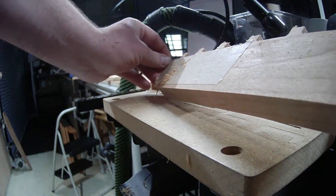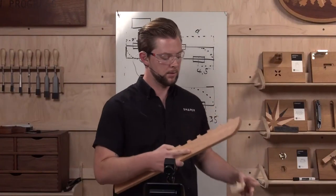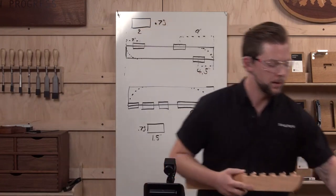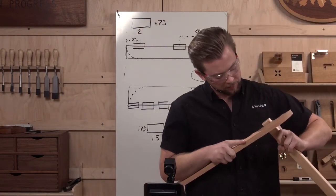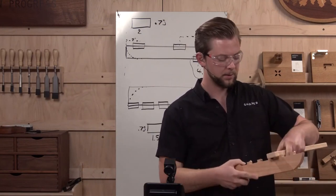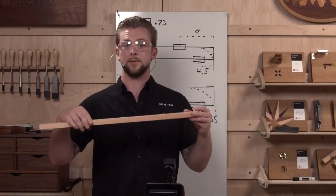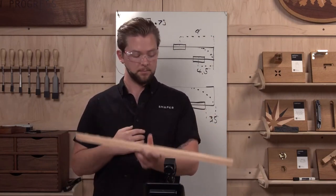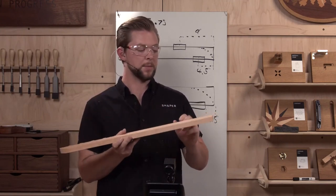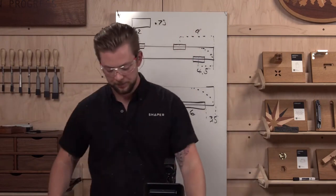All right. There is our seat slat. All right. So I decided to go the 0-inch offset again because I'm looking for that nice tight friction fit, and that was going to get it to me. So, for the last and final piece, again, we're just going to flip it one more time. This side, the curve, the outside radius goes the same direction, but we are going to make that little cutout as well so that the two pieces fit together in its final assembly.